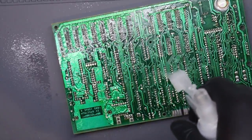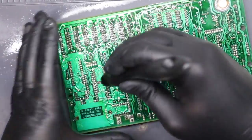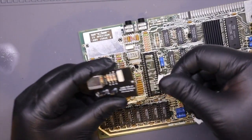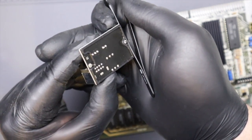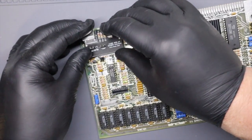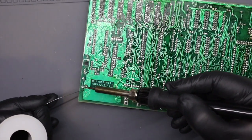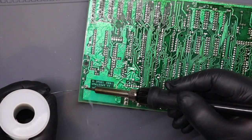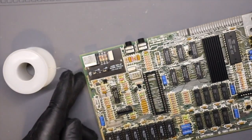Now that the board is cooled I give it a quick clean with some IPA and start the installation with the modulator board. I'll remove the cable from this end to help with fitting — you'll notice on the bottom of the board there's a gasket that allows the board to sit flat against the PCB and not short out. Two pins are pushed to the other side of the PCB and soldered where the old RF-can once sat. Adding more solder fixes the pin-size difference quickly. Before finishing up, just make sure you're happy with the alignment and its final position.